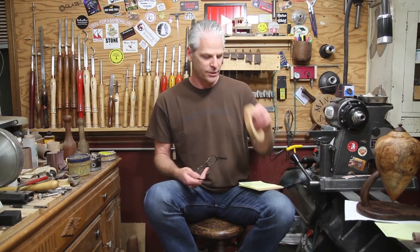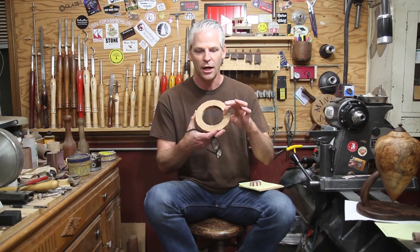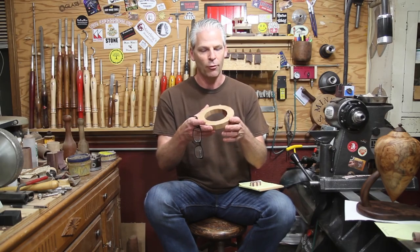I'll link to an app where you can figure out the segment ring sizing. For the genie bottle, I found a picture on the internet of the basic shape and then cut some test pieces to see the diameter. But there's an app where you can punch in how many segments you have and it'll tell you what size to cut them. So you can determine what size ring you want - if you want an eight inch ring, it'll tell you to cut them an inch and a quarter, or whatever it is.